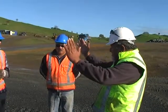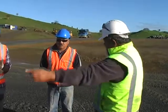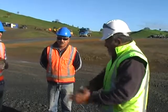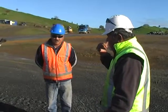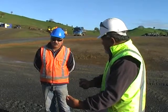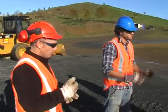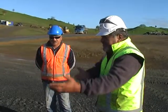Use that full signal, i.e. when you're taking up the strain, you've just about got it, you've got it. And then from there, you go to each one, point, whatever. All right? So make sure that your signals are clear to everybody. Most sites you don't have intercommunication. I see. Okay? So those are the sort of things you should be looking at. Any questions, guys? It's not as hard as you envisaged it to be.